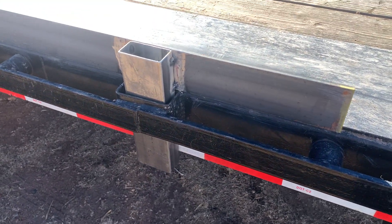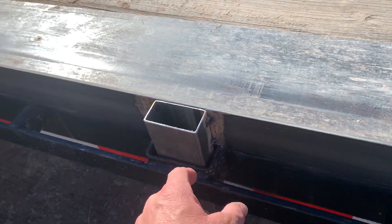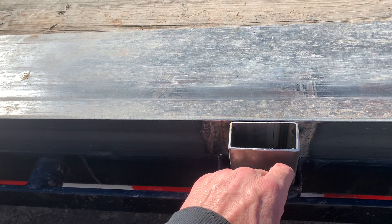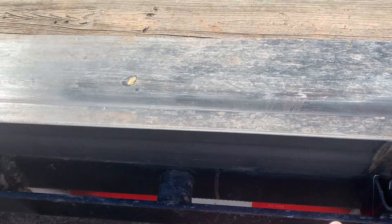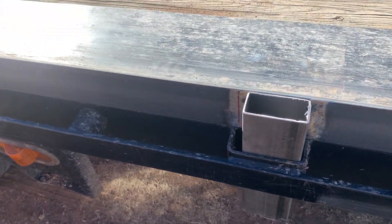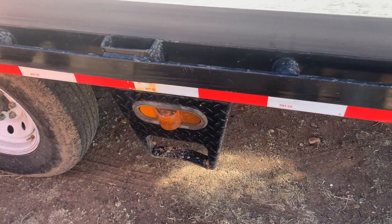I want to make sure they all lined up well before I throw heavy beads of weld on this stuff. This is quarter-inch steel here, this is eighth-inch steel here. I used quarter and quarter the first time and felt a little more secure, but I couldn't get quarter-inch up here so I went with eighth-inch. I'm going to fill each pocket with a plank of metal rather than separating and gapping them.